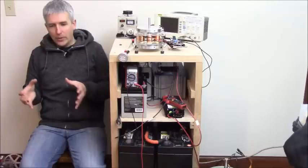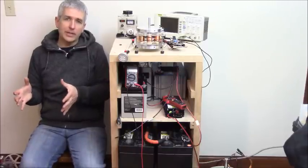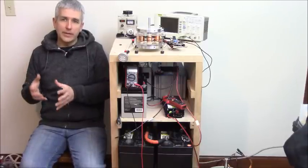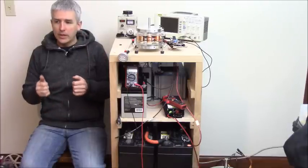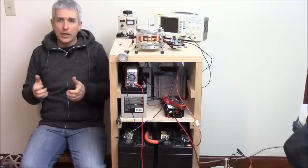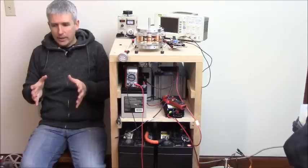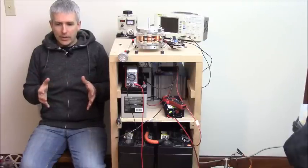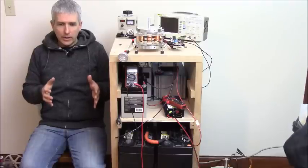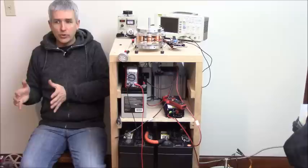But when we do a controlled test, that's why I've always done the 10 cycles, so that you really understand your battery's capacity. You're not dealing with a sulfated battery that's giving you high voltages and no real capacity. Control load with resistive loads that you measure voltage and amperage, and the amperage is the wasted energy. But anyway, the rate of wasting the energy. So one battery is powering the motor, X amount of joules, calculated, added up, and the other one runs X amount of joules into another load.